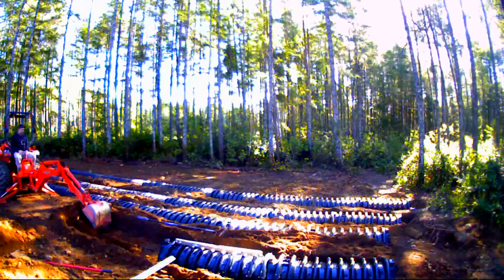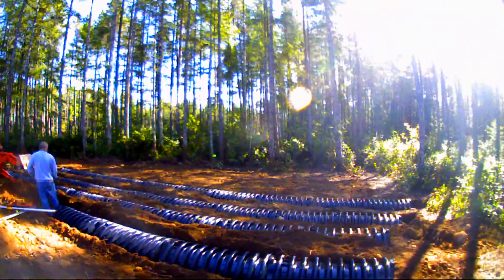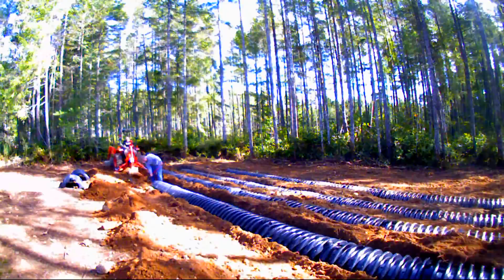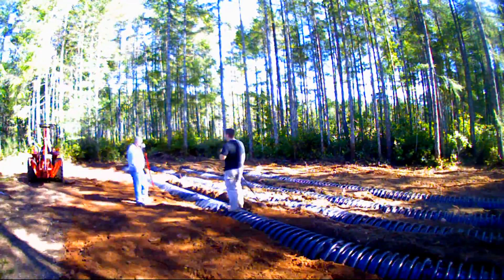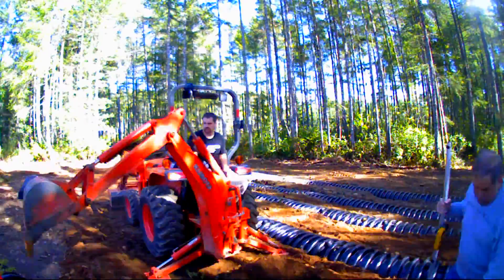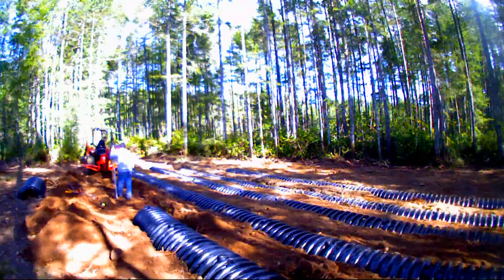This goes pretty quick. He's got a laser level out there and these get installed perfectly flat from one end to the other. It's pretty important that you use a laser level to get them perfectly flat. If they look close, they don't check — but if they don't look close, the inspector will check and that doesn't work out well for anybody. So just take your time and make sure they're nice and flat and you won't have any major issues.